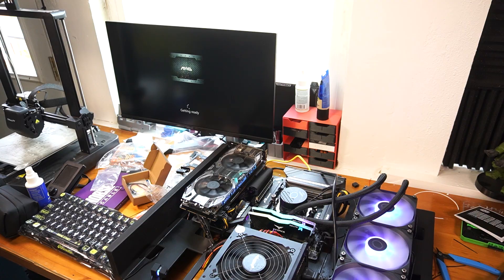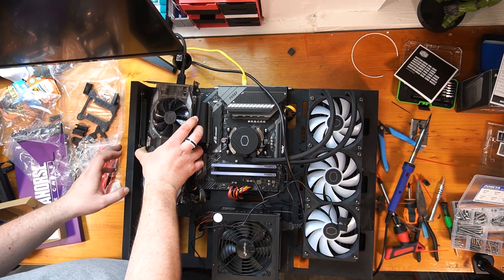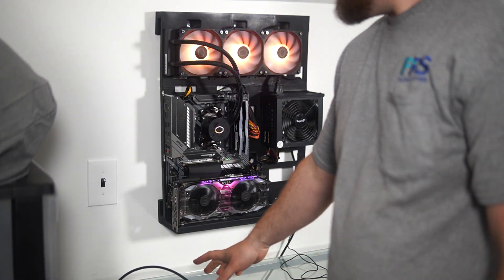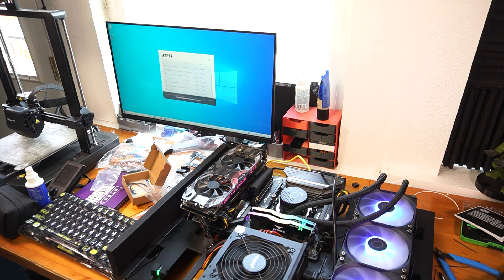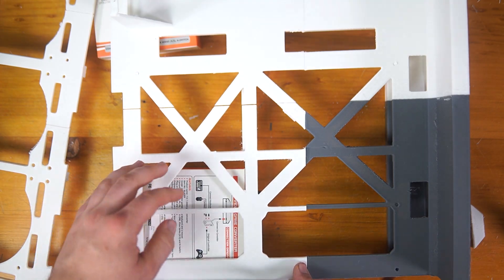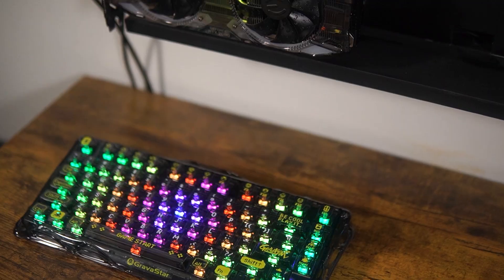Looking back, I probably should have used a more heat-resistant filament. I printed the case in base PLA, which is versatile, but there are better materials like PETG or ABS that can handle higher temperatures and stress better. If you've made it this far, thank you. The link to the 3D print files will be in the description, and hopefully by the time this video goes live I've made a few improvements to the design, so it'll be easier for you to print and assemble it yourself. Overall, I'm incredibly proud of how this turned out — this was a dream come true. Sure, it's not perfect, and I know I'll continue improving it over time.